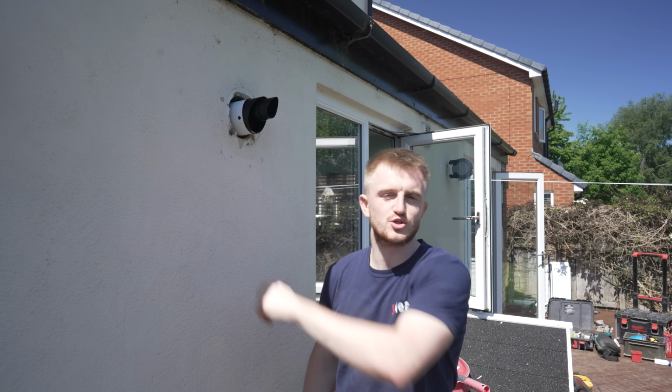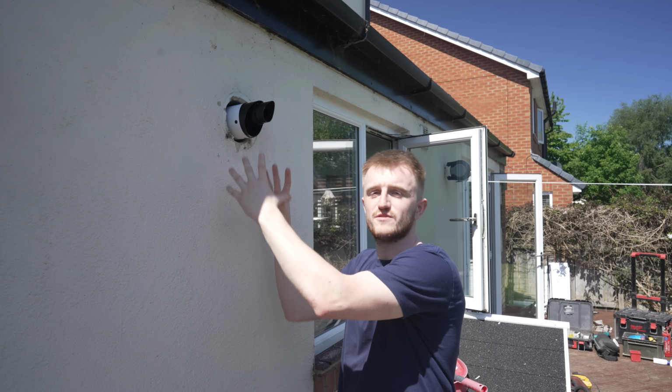I am an iHeat installer, but it's Kai. Hey Barry, it's Jacob. Hiya, you alright? Hi, yeah. I didn't have your number, so I just rang iHeat. Fenney needs a cage for this flue. He did need the extension, but he needs a cage. Right, okay, don't order it now. Yeah, no worries, we'll do it that way. The old flue is under 2 meters, so we need to get a cage to go over the flue to protect it from people walking by, animals, debris, etc.